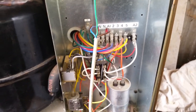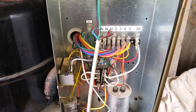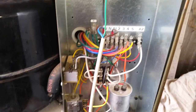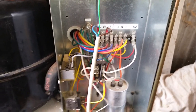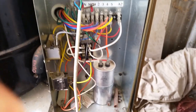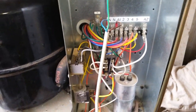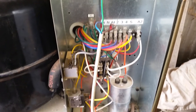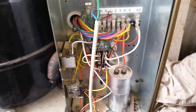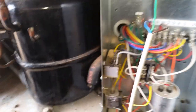240 volts is the RMS value of the voltage. RMS stands for root mean square, if you didn't know that. That's what it would be equivalent to if it were DC. So just a quick lesson in electricity and safety — keep in mind that all of this is going to be live at mains potential. Cases like the capacitors there do phase shift, and you can get some really high voltages compared to phase-to-phase because it's shifted, so it's going to have a different value. I've measured them and you get funny values on those capacitors. Just be safe.